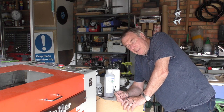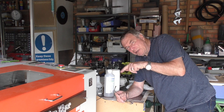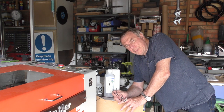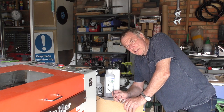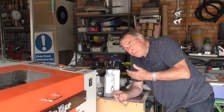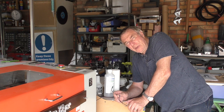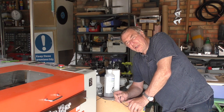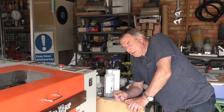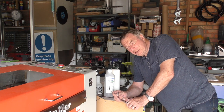The really interesting part of this exercise has been trying to decode how we turn white titanium dioxide black - and that all comes down to heat changing crystal structure. From quick tests on a tile I know it makes a black mark, but around the outside of that black mark we had a melt pool of glaze. To do photo engraving - proper photo engraving - requires precision dots, and I'm not sure I'll get precision dots off the CO2. I've seen photographs from diode lasers that look pretty good. I'm extremely happy that Nicky discovered this process, and if it was him, I can only thank him for advising me to use an airbrush because that has solved my application problem.